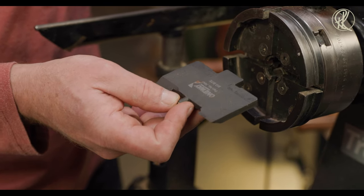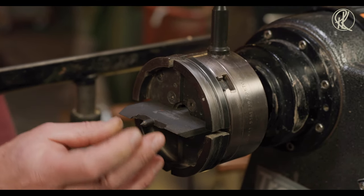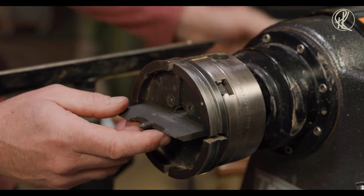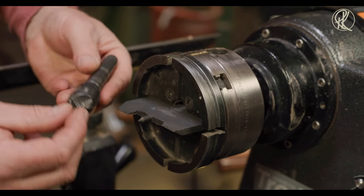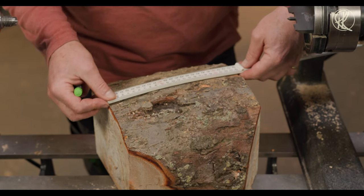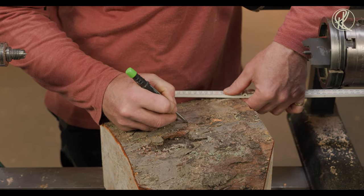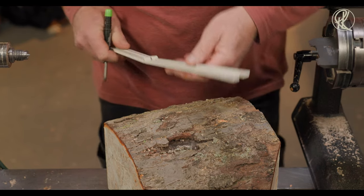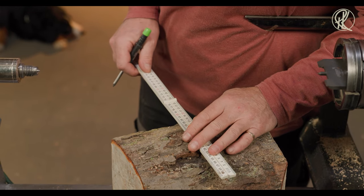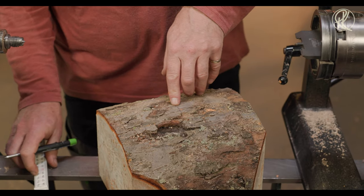The big bite spur, it has got its teeth way out of the middle. Therefore, it has got much more driving power. For instance, if you compare it to this one. Let's find out where the center of this piece is. It is 24 centimeters like this, so I'll put a line at 12 centimeters. And, well, we have to make a guess more or less with 27, so somewhere here. So this should be more or less the center.